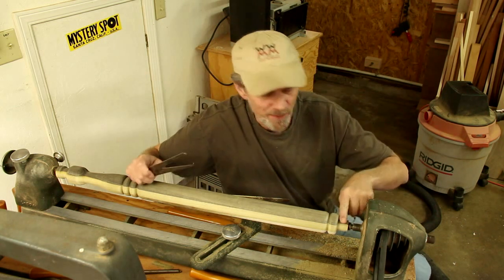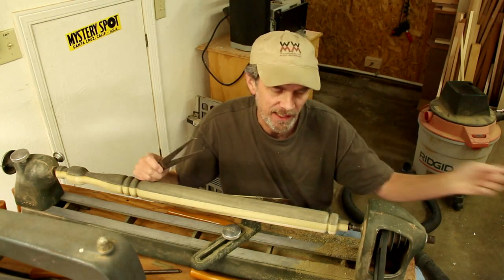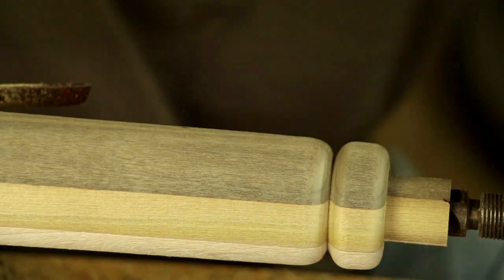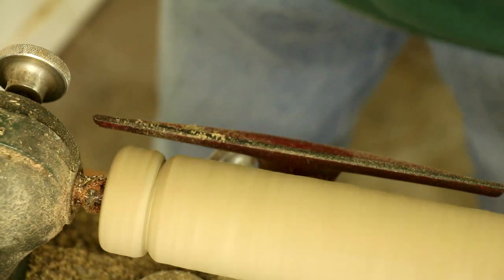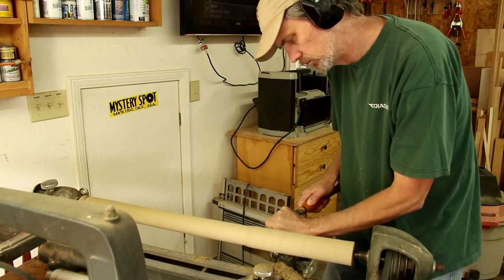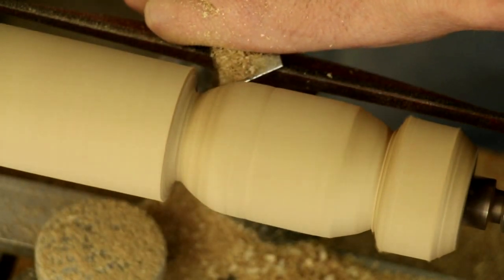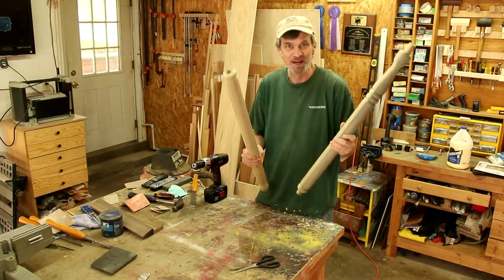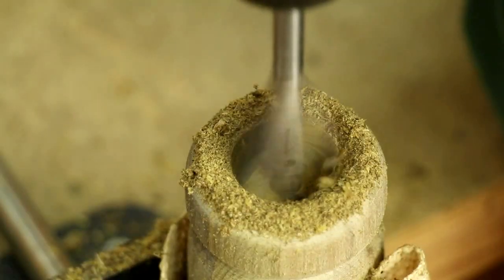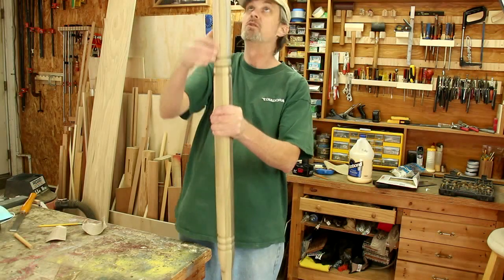This top part — I've made a little peg that's one inch in diameter, and my idea is that it will fit into the other section. I've also created this bead here in hopes that it will kind of disguise where that joint goes. On my next spindle, I'm trying to make a bead that matches the top bead on the lower spindle. Turning is a lot of work, so this took quite a while to turn both pieces, but I think they're going to work out and it'll kind of conceal that joint there.